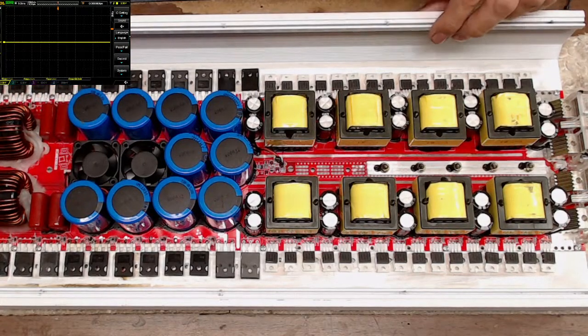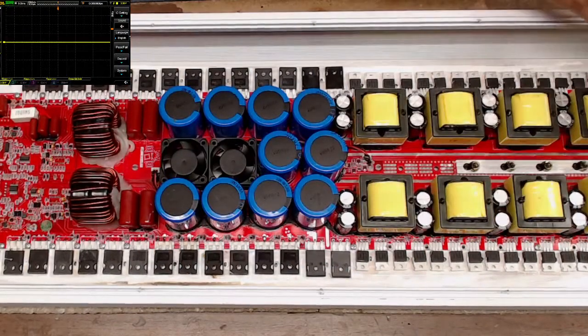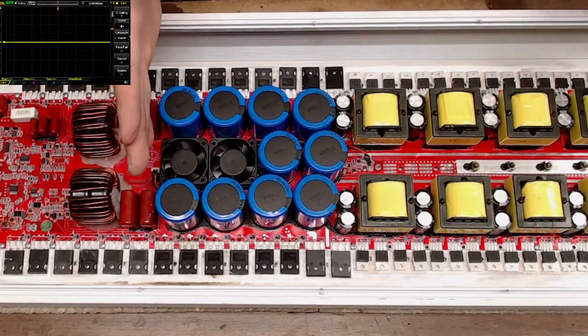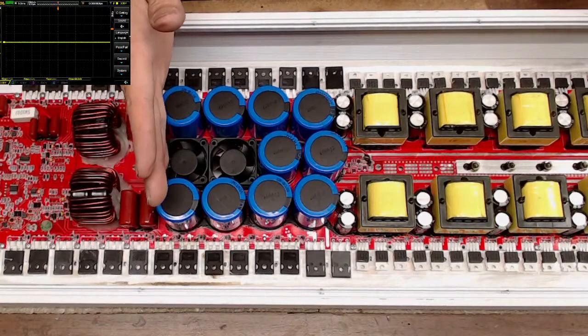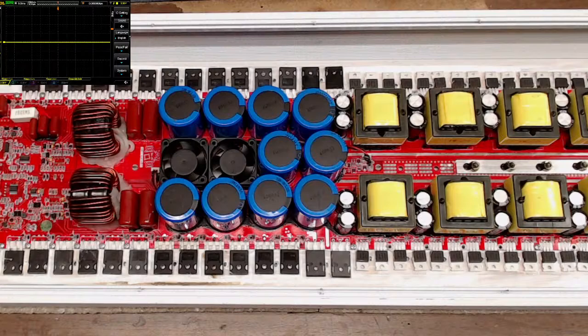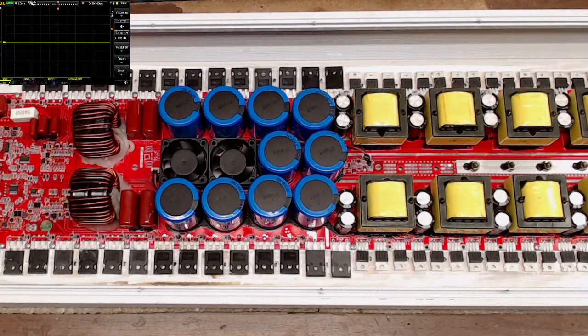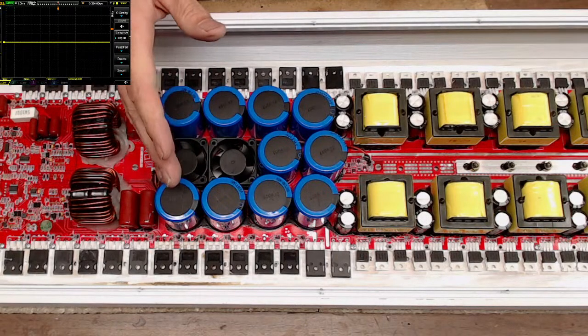So from here back is nothing but your power. Three quarters of this amplifier is nothing but a power supply. It's a switch mode power supply is what this is. And what's the voltage? These are 200 volt rail capacitors, so you're probably upwards of 180 volts per side, I would say, on your rail voltage. So that's all this is. It's a switch mode power supply.